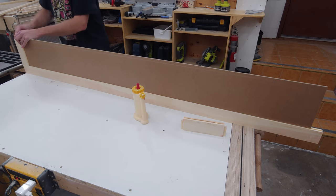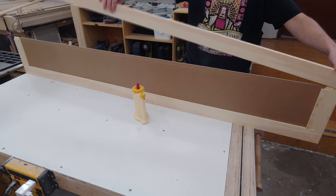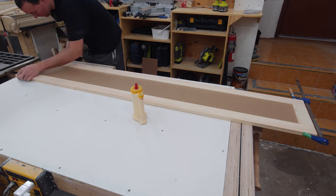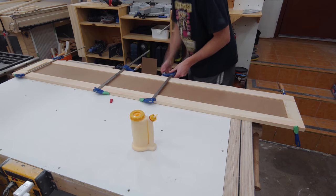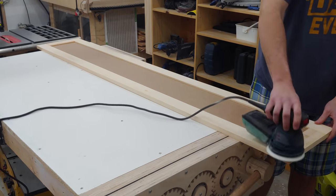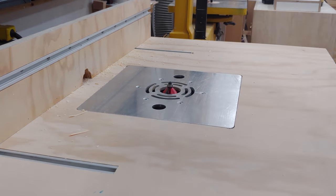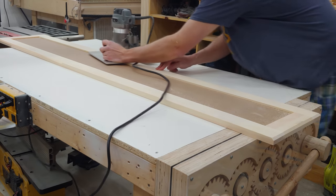I make sure to have lots of glue on the tenons at the end and begin assembling the door. A clamp is added at each end as well as a couple in the middle to make sure the center measurements match the end as the stiles seem to have a slight bow in them. I then sanded all sides with my random orbit sander and then over at the router table gave a quarter inch chamfer to the outside edges. The location of the router table in my shop made it so I couldn't complete this operation, so I took the router out of the table and finished the chamfer over at my assembly table.